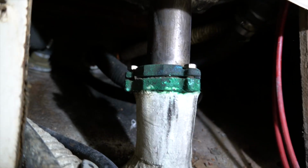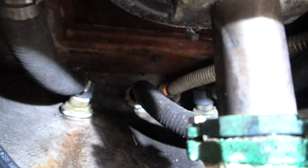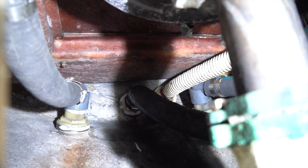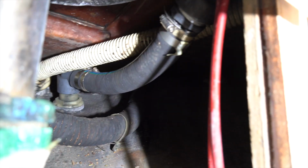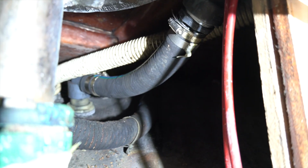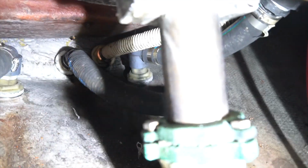All right, this is your rudder shaft seal. See some water dripping in because it's raining out from the top. Center hose. Does it look like those hoses were replaced? Yeah. Center hose, that hose right there is your exhaust hose. These hoses here are your cockpit drains. They're newly replaced. And next season, you'll have Guido replace your exhaust hose there.